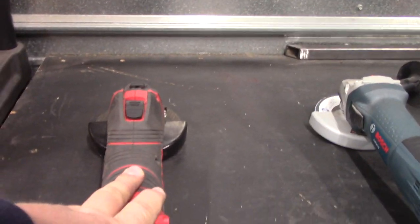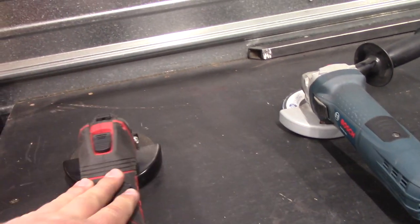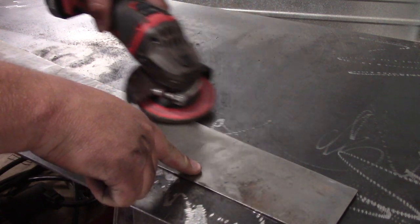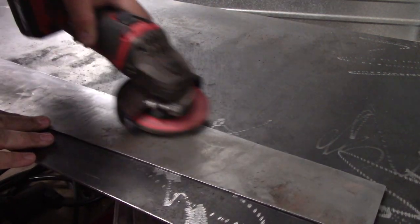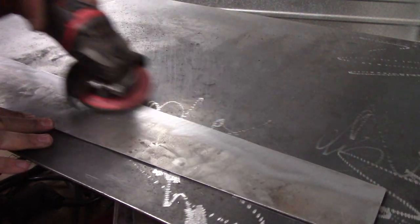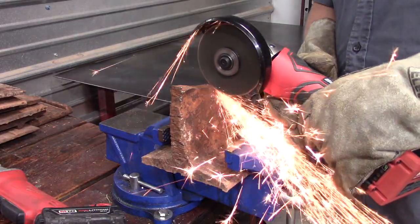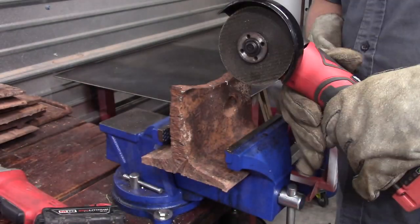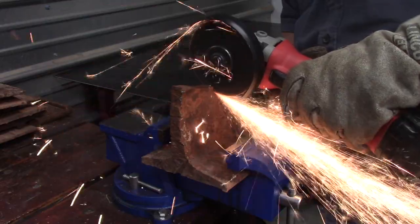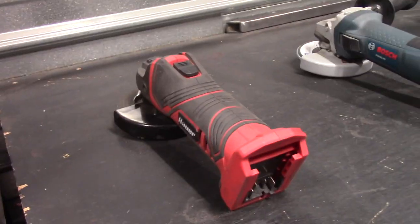This video is not necessarily about the cordless angle grinders but I thought I'd throw it in here. My Bauer is definitely the worst grinder I own. I know I made a video saying it doesn't suck — it doesn't in comparison to other similar grinders like the Milwaukee I compared it to. They both have these thermal overload switches that shut them down when overworked and overheated. This one shuts off a little bit too easily. The Milwaukee was only slightly better, but that's the nature of these brushed motor cordless angle grinders.